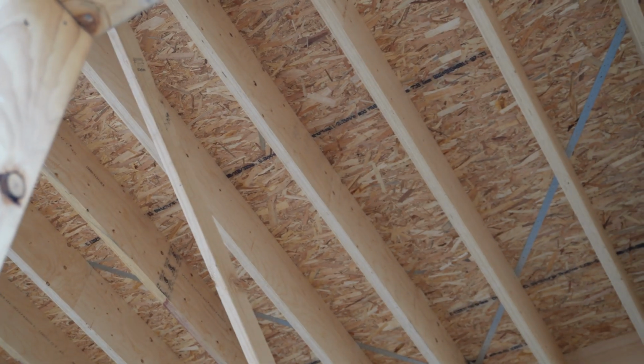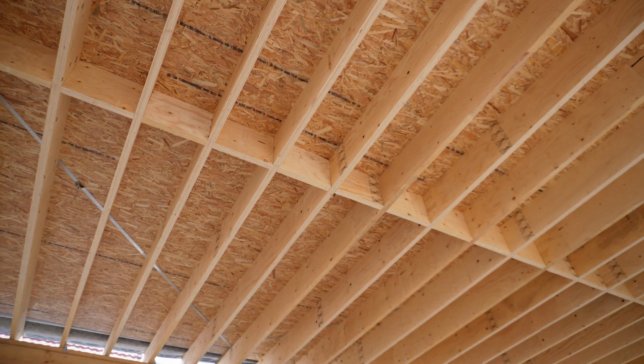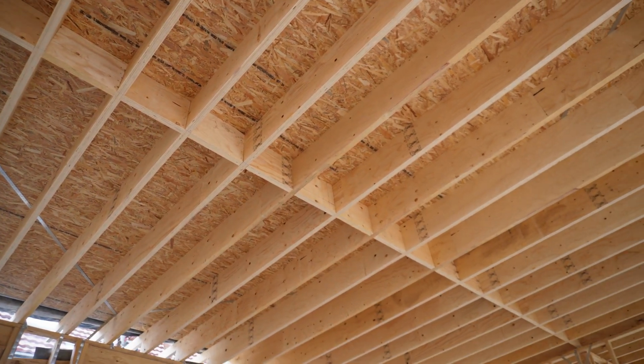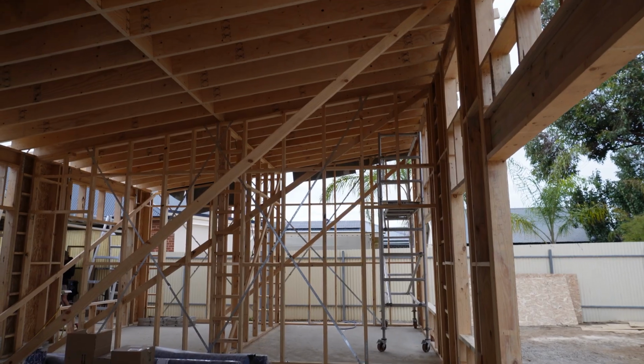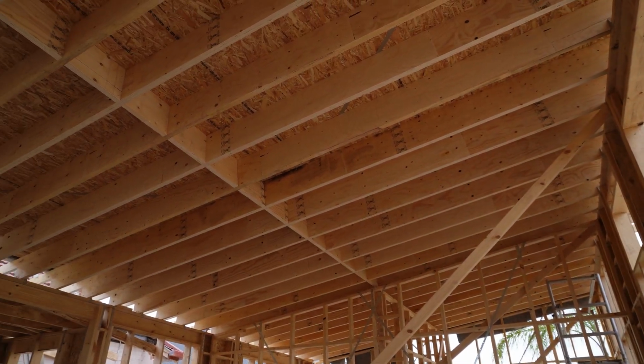Okay, first thing I want to kick off with is our rafter centers. If you look up above me, you'll notice we've got some giant LVL rafters up there to be able to span over our nice big open plan kitchen living area. So what we've done here is close these up to 450 centers to eliminate the need for any extra ceiling battens. Why we've got them at 450s instead of your traditional 600 fixings for ceilings is we've upped the size of these insulation batts to an R6.